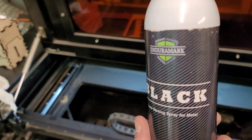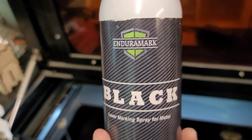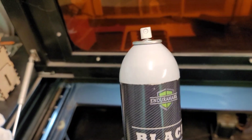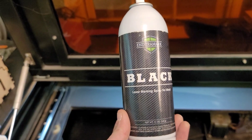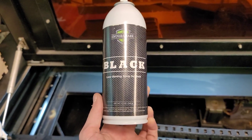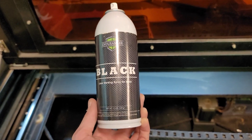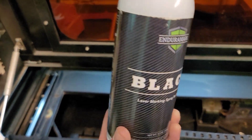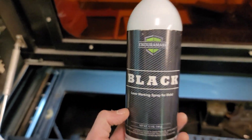One thing you'll need — a lot of people buy some gunk from Home Depot, I think it's called Molly something. I use this stuff called Enduro Mark — I'm not sponsored, but I would gladly accept that. It's a laser marking spray for metal. Essentially you spray it on the metal surface and engrave over it. It's a powdered metal coating that, when the laser beam hits it, makes your laser burn hotter, so you actually get a good marking on the metal instead of just etching it. It comes in different colors — blue and others — but I went with black.